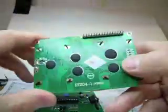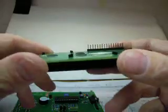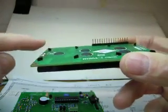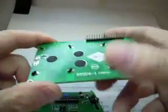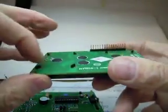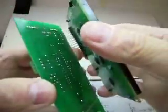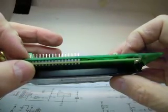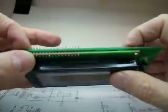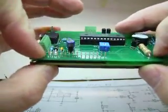On the back of the LCD you'll see these little black protrusions where the LCD cover is held on. You just need to stick some little pieces of foam on each of those so that when it's mounted on the board they don't contact the circuits on the bottom of the board. Just a small piece of foam — you can see that's a very nice close fit.